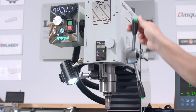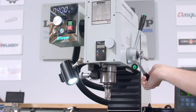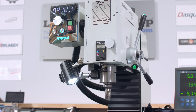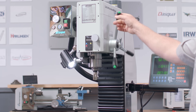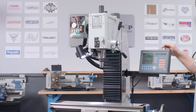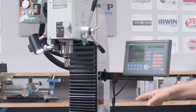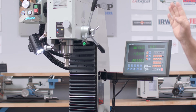You've got a true quill, and on that quill you've got a depth gauge in front of the machine that allows you to measure and accurately repeat the depth of cut. This machine also comes with a three-axis DRO — a hardwired DRO on the side tied to magnetic scales on all three axes — that will do all the normal DRO functions, bolt patterns and the like.